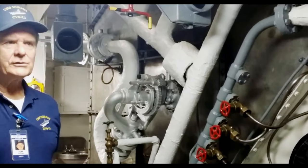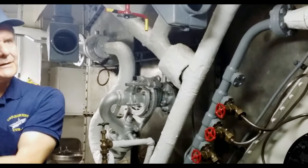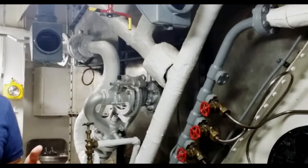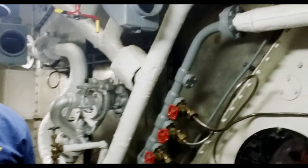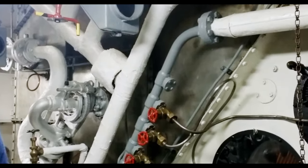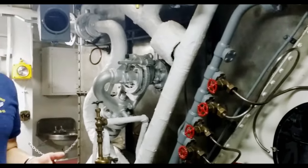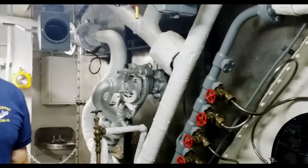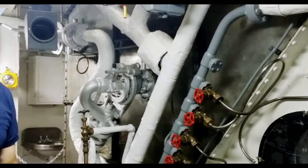When they did that, they had to make sure the ship was positioned so that the soot would not go onto the aircraft — you don't want it on the deck or the planes. It was a very calculated thing that required permission from the captain to do, because the soot is highly acidic. But you had to do it because the efficiency of the boilers had to be purged; otherwise you'd get really bad fuel consumption efficiency.